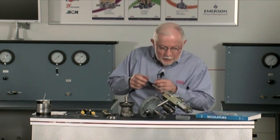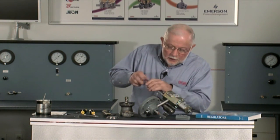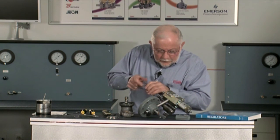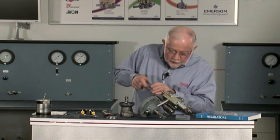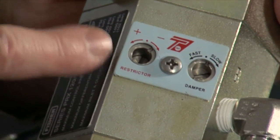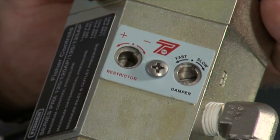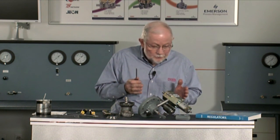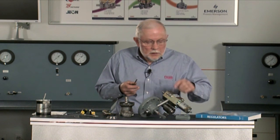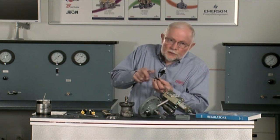The pilot itself is a PRX — it's a double diaphragm pilot. We're able to take this bottom cap off and check the seat in it without releasing our spring pressure, which is quite an advantage so we don't have to reset the unit when we put it back on the flow line. The double diaphragm makes it balanced so it's extremely accurate. On the side we can see there are two different settings: one is a restrictor and one is a damper. Most elastomeric regulators have a restrictor with them that allows you to set the gain or accuracy of the unit. With the PRX you can maintain that high restrictor setting and bring the damper down, which restricts flow from one diaphragm to the other and takes out instabilities, making the regulator extremely stable on low flow conditions.